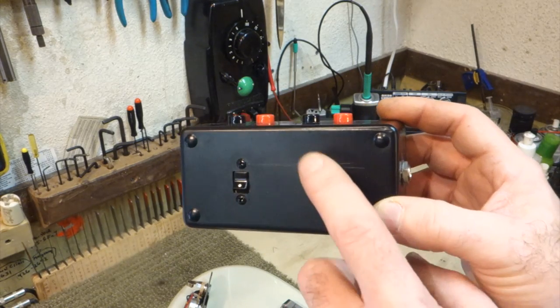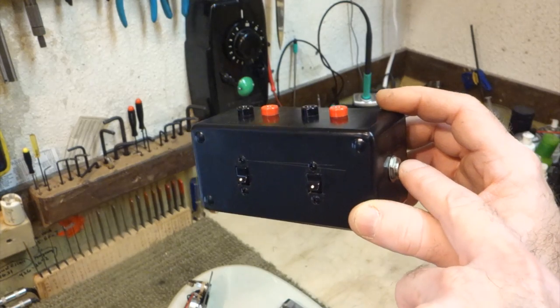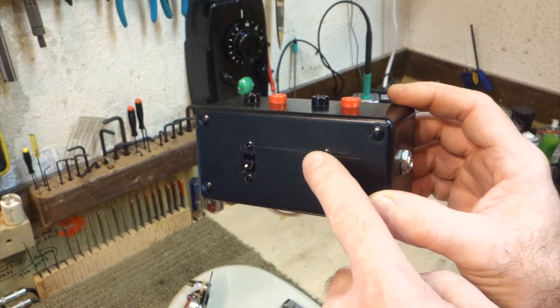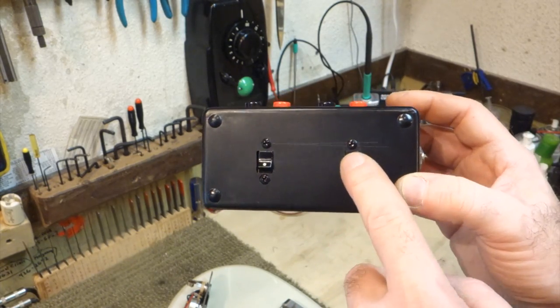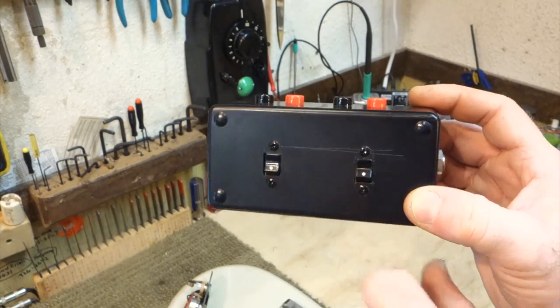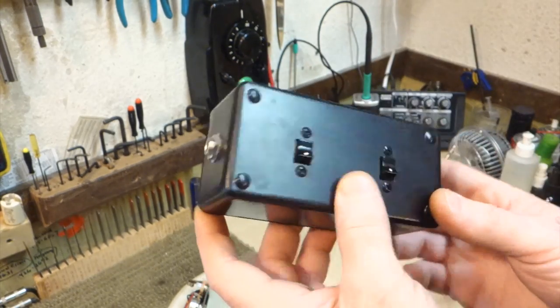Very simple little box — anyone can make it. Good idea to set the output to short out the amplifier across the tip and the sleeve when it's in meter output mode, so you don't get all the buzz from the amp. That means you do need a double-pole double-throw switch for the output, but the input can actually just be single-pole double-throw. Just connect all the grounds together on one bus and you're good to go.